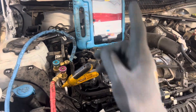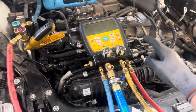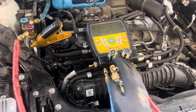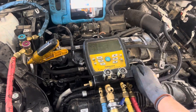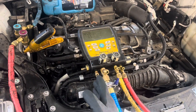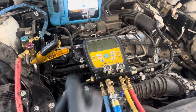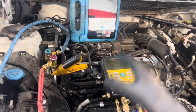I'm going to do it two more times. I'll sweep nitrogen through the high side — low side will be off — get it up to 1-2-3 psi, then close the high side, bleed it out the low side, and then vacuum it again. Get it down to about this point; it'll probably go a little lower after that.